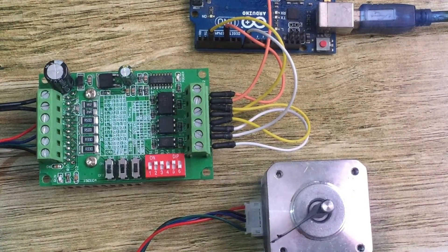On the other side we connect the stepper motor phases. One pair of coils is connected to these two terminals here, and the other motor coil is connected to the other two terminals. In my case this motor comes with wires from the same coil next to each other, which makes it easier. But in some cases you may not be sure which wires come from the same coil.